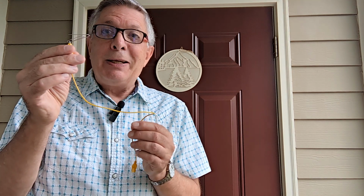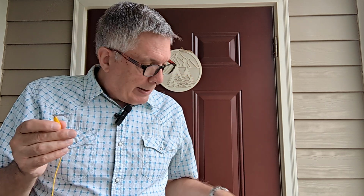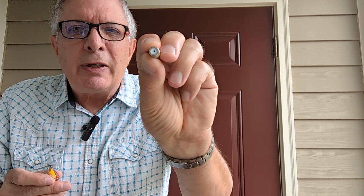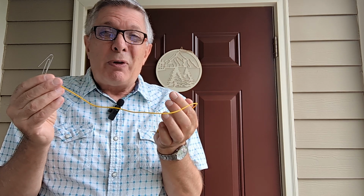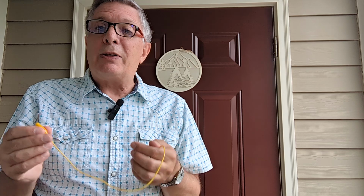And I did that by attaching this wire to the back of my TV at the connector. It's called an F connector. See that? That's the connector on the back of your TV where you can connect cable and antennas for free-to-air TV. So what I discovered was, indeed, with just this wire, I could get maybe more than 40 channels. I said, okay, there's hope. Then I can go ahead and spend the money to buy one.